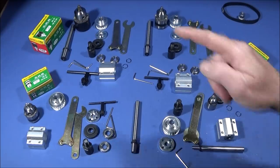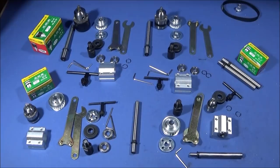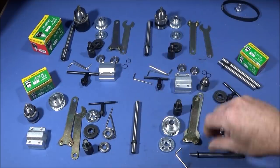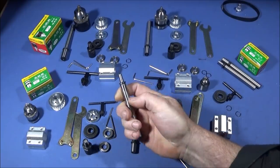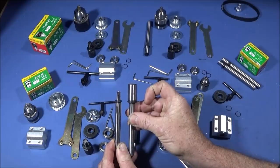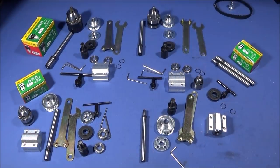If you're new to engineering, JT0, B10, B12, and B16 refer to the actual taper in the back of the chuck and also the taper on the spindle that fits into it. For reference, this is the JT0 and this is the B16 taper — you can see the completely different sizes of those tapers. You can choose from all these different sets, and at the moment they're on special offer with 65% off.